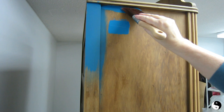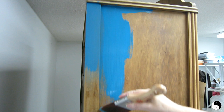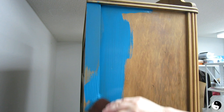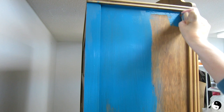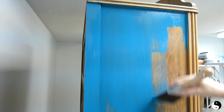I'm dipping into the paint now. I did not notice bleed-through on this little test strip that I did, so I'm really hoping that's the case and it's not just that little patch. With some of these darker colors you can do just one coat because there is pretty good coverage — we'll see how it looks. Just continue to mist your brush as it gets dry. I love how this angle brush gets into all the corners.